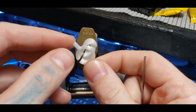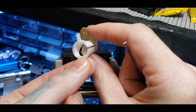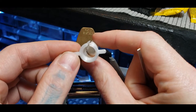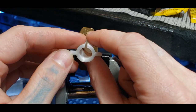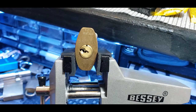What it does is when you spin it around from the inside, you can pin one driver at a time. And as you spin it, you can see how the rest of it covers all the rest of the holes once you're done. So you start at the first pin, second pin, third, fourth, fifth, sixth, and then you put it in there. But let's show you how this all works.